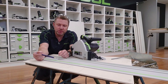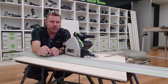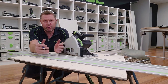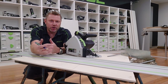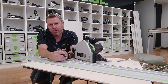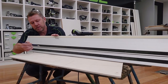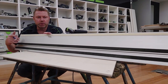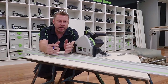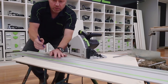Here we're going to have a look at the application of cutting cement sheet with the TS-55 and the guide rail. The benefit of this is we can get really good dust extraction and also work really quickly. In some situations we want to clamp the guide rail, but with cement sheet we don't always need to — as long as we're working on a flat surface, the weight of the saw is enough to hold the rail in place.